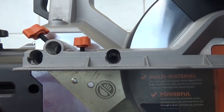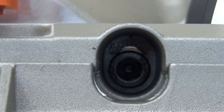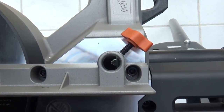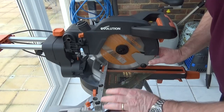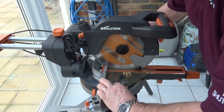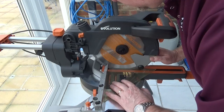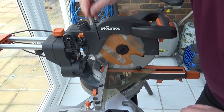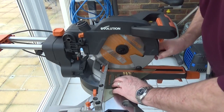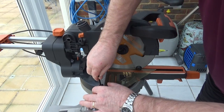To adjust the fence, we use four slotted holes — two on the left-hand side of the saw and two on the right. Each has a set screw in a slotted hole. Slack off those set screws, slide the set square along the fence until it's touching the blade, then adjust the fence backwards and forwards until it's at 90 degrees. Tighten the two end set screws first, check it hasn't moved, then tighten all four. That's the first adjustment made.